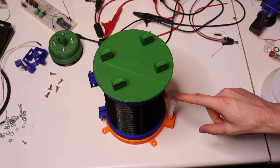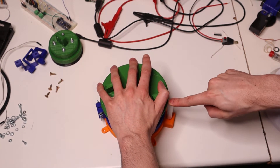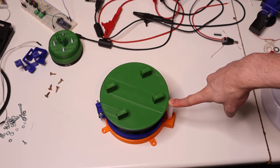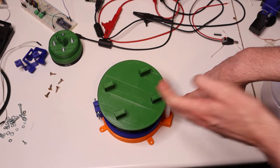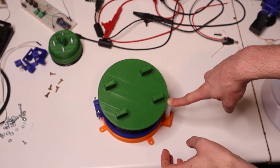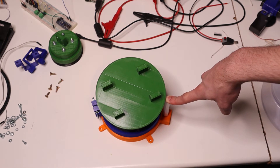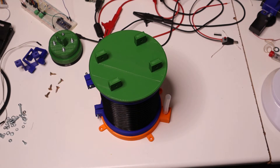The first thing I want to show you is if I compress the bellows all the way and then seal off the exit hole with my finger, you see that it rises very, very slowly. So right now this plate is being pushed up by the springiness of the bellows, but it's at the same time being pushed down by the air pressure on the outside being greater than the air pressure on the inside. And just for comparison, if I let go, that's how quickly it goes up.